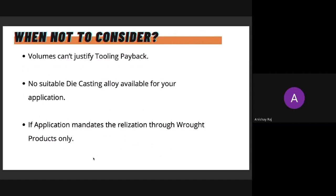not possible through a die casting alloy. I covered this a little bit earlier. One that we recently went through is ZM21. ZM21 is a magnesium alloy which has better thermal properties than most aluminium alloys, but it's only a rod product. So when the customer wanted it in die casting, we could not offer that because it doesn't die cast that well. These kinds of things happen, and that's something to consider for yourself as well.